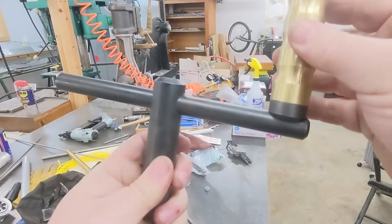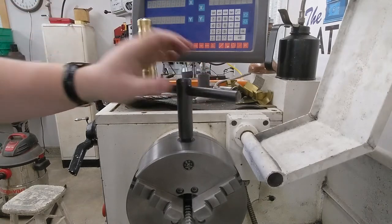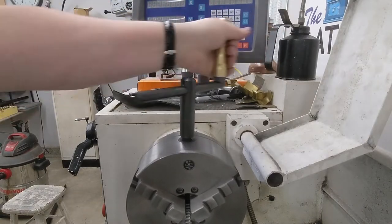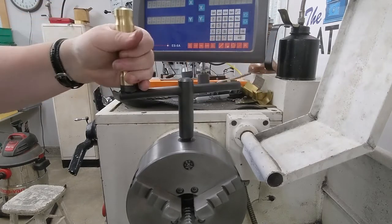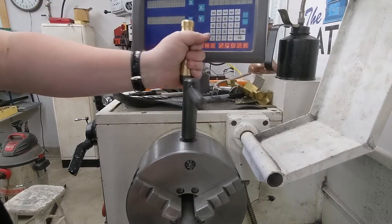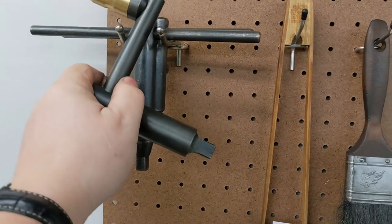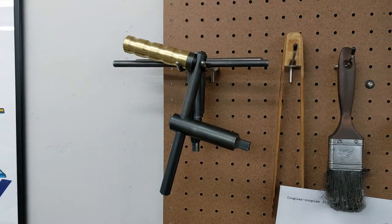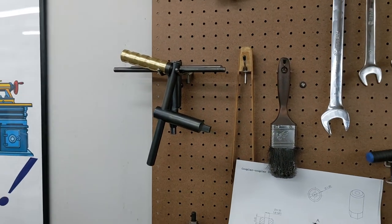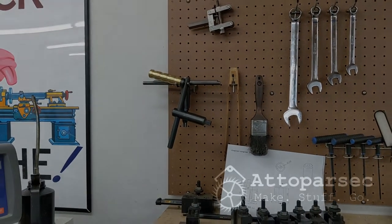It has a delightful heft and works pretty well. Best if the lathe is in a low gear so the chuck doesn't rotate too freely, but still workable even in the 400–700 RPM range I usually leave it in. And because the crossbar is the same length as before, it can still be used two-handed to really snug the chuck down on a part. It even hangs nicely on the existing chuck key holder. Not too bad, I think. Thanks for watching, and be sure to subscribe to catch the upcoming video for the Fremen Thumper project.